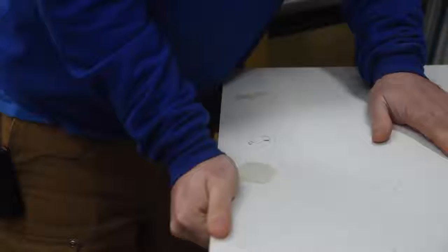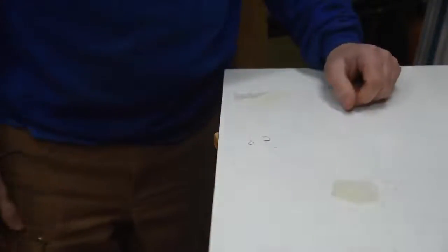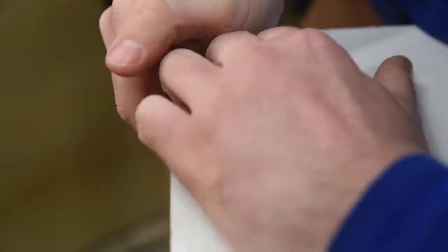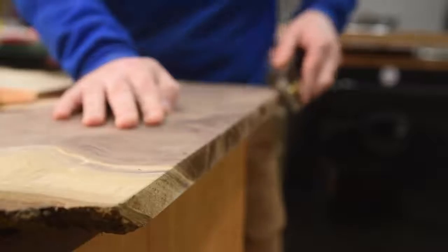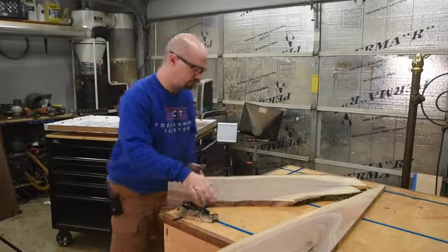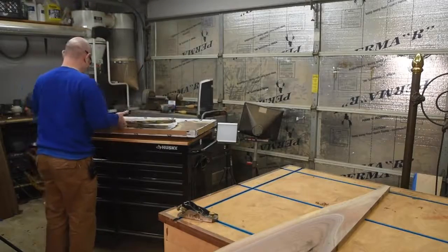Then I decided to check the epoxy again and realized that before I'd just made the boneheaded mistake of not letting it fully cure. This stuff does actually pop off the whiteboard, so all that tape was unnecessary. Anyway, it's time to load the form. Except my boards won't fit tightly into the corners now that they're siliconed, but just a few swipes with the hand plane is going to add enough of a chamfer to mostly take care of that.